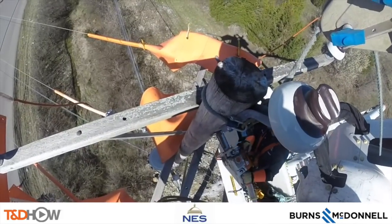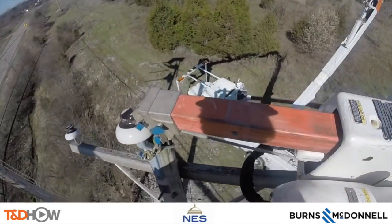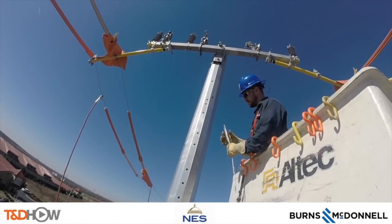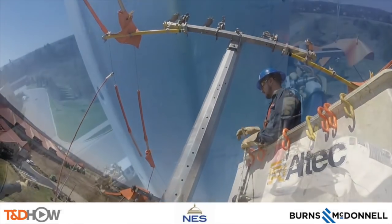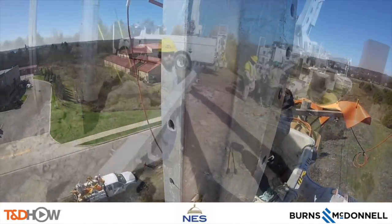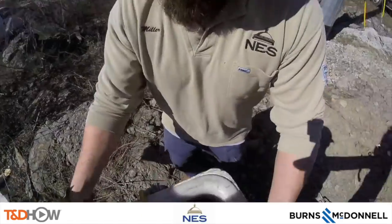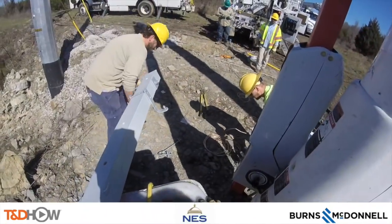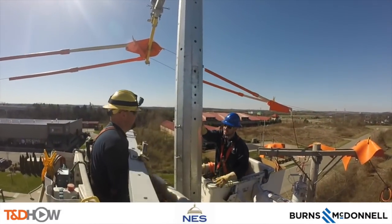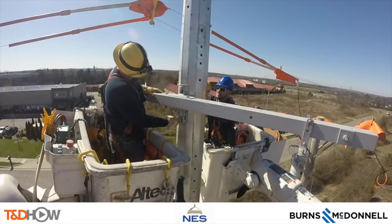Next, they are going to cut off and take away the top of the old wooden pole that is being replaced. And now it is time to measure and drill for the placement of another cross arm. This one will be at a bit of a diagonal, and it will feed another primary buck line that crosses this road. You can see the ground crew handing up that next cross arm with the bolts, and here they are back up on the pole attaching and securing that cross arm to feed the buck lines.